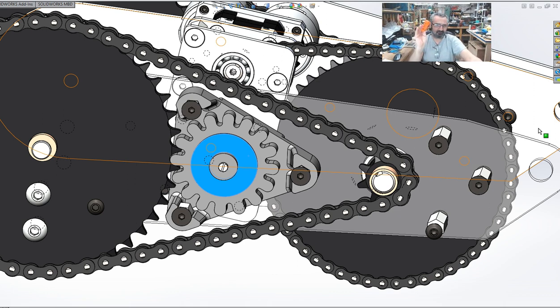Now, there's a safety feature built in. When things go awry and there's a malfunction and the thing keeps tipping, our potentiometer is only good for 3 turns. Anything over 3 turns, it will hit the end stop. But this is just a slight friction fit, so the gear can continue spinning. The potentiometer stops. No damage to the pot, no damage to anything.